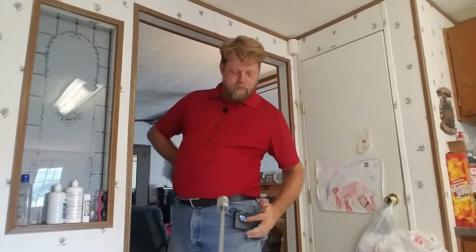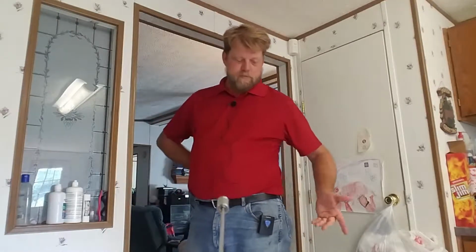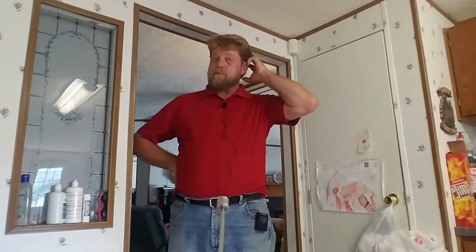I have this Lavalier microphone turned up. Watch, I'm going to hit the mute button. Mute, and it still works. Alright, this mic is too hot. I'm going to have to reduce the sound output considerably. This is utilizing the homemade cable that I made. Once I get it shielded, it should help it a little bit. Like I said, right now it's too hot. It's probably overloading the amplifier circuit within my phone, and it's cutting out.